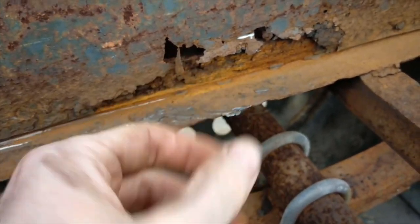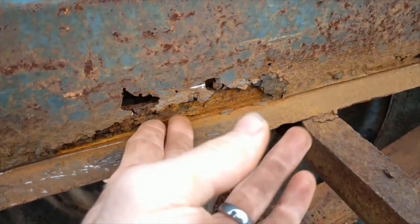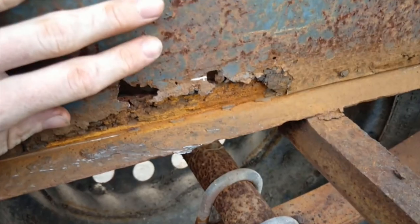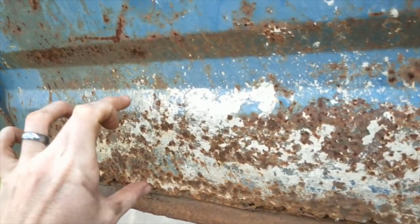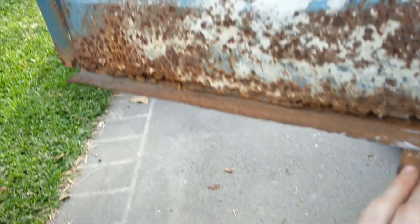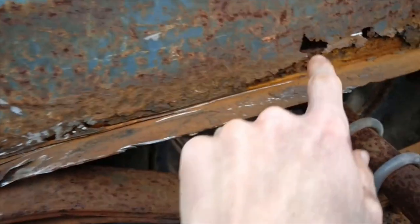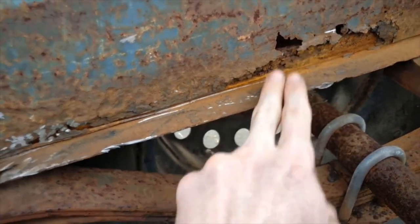But yeah, after welding that down, you can see how bad the body really is. It's really that bad. So there are no ifs or buts. As I said in the last video, I'm going to have to go along here and cut this whole entire thing off everywhere. I also cut into this, and I just realized that this is another L bracket, the same as these other ones. Although I think this is going to be savable, I'm not 100% sure on that one. If worse comes to worse, at least I know what to order if it does get that bad. So that's a nice tip right there to know.